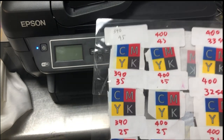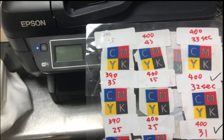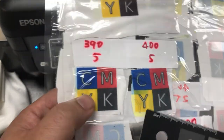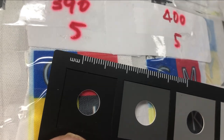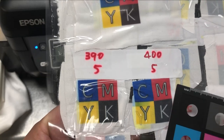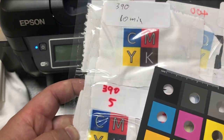However, if you do too much, what happens is called desublimation — the black color gets transferred back to the untransferred state because you cook it too long. So then you're going to see brown again. We start off with 390 degrees at only five seconds — you can see it's really brown, so it didn't transfer enough. At five seconds, whether it's 390 or 400 degrees, they're all pretty brownish. Let me show you the overcooked desublimated result: cooking for 10 minutes at 390 degrees makes it even browner, because the black has transferred back.